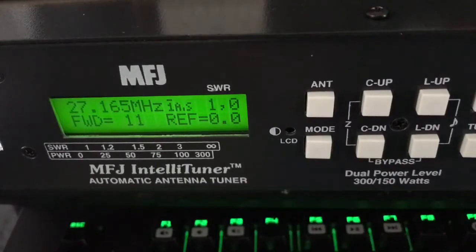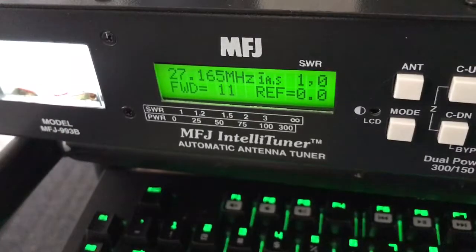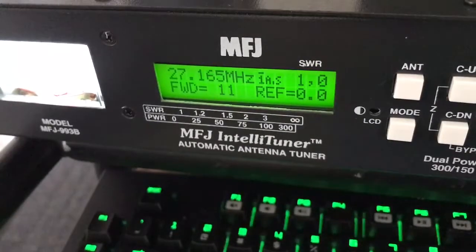Just a quick overview of the MFJ993 Bravo autotuner I just got. It handles two antennas and I'm pretty happy. I can take this thing all the way up to 28 MHz with a high SWR, tap the button, and bang — it's fooling the radio into a match. You still want to have a resonant antenna if you can get it. But for guys who can't afford multiple antennas or don't have yard space, if you get something in the ballpark you'll be able to transmit. I hope that was helpful — take care.